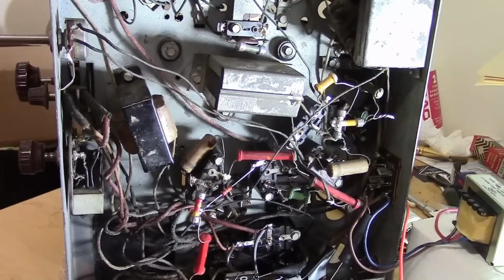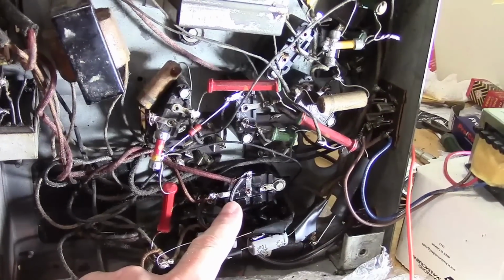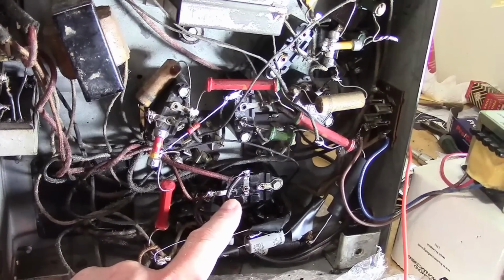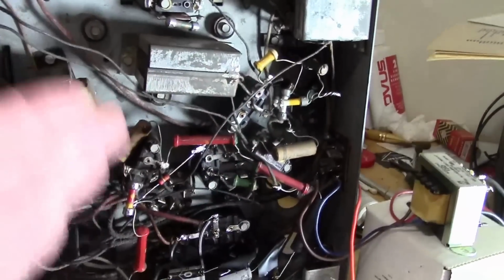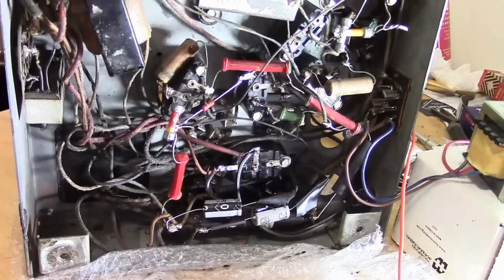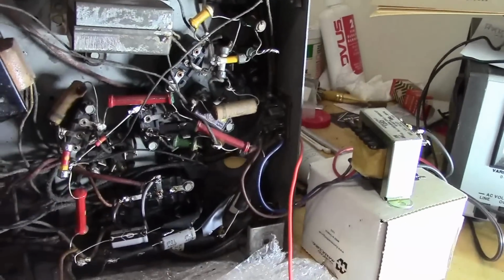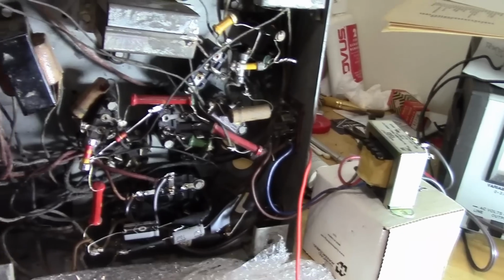I'm learning plenty myself, for example, about that capacitor being not just for line filtering, but to serve as the ground for the antenna. Of course, in hindsight, you've got to either ground the chassis to a really good ground or get that cap in there, or it's not going to work right. I hadn't really thought about it that fully before. And I haven't played around with substituting output transformers before either, so I hope we're all learning something as we go through this process.